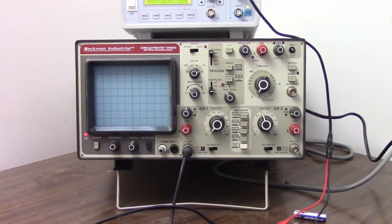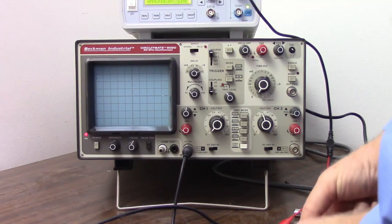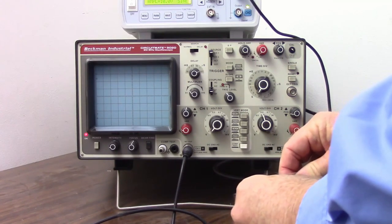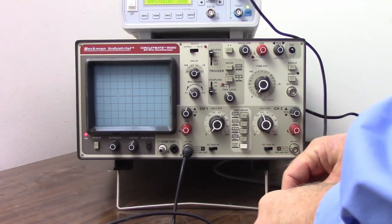screen. Now, usually an oscilloscope is used to freeze time so you can observe things that happen much faster. So let's put something on here that is happening fast enough that we need to freeze the time. I have a function generator on top of the scope, and let's go ahead and hook that up. I have it set right now to take 10 seconds to cycle through a whole wave. We'll see what I mean by that in just a moment.